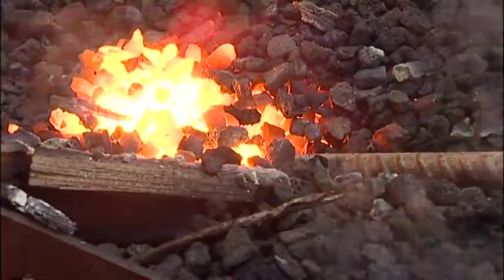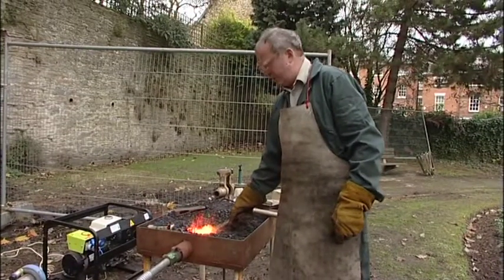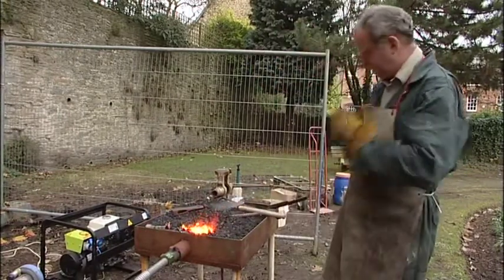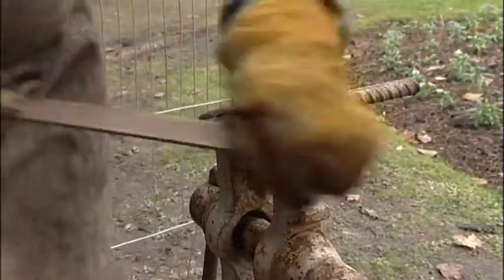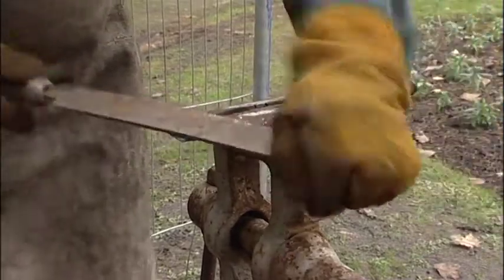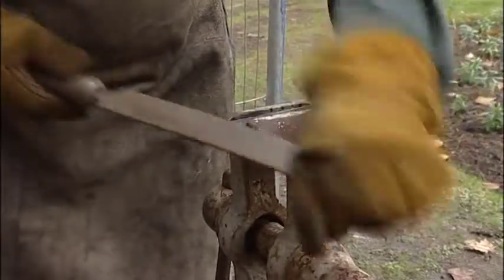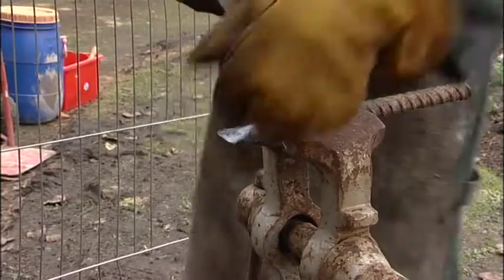The tool is reheated to approximately 800 degrees centigrade, which appears as a cherry red colour, and then it is placed into the coke to cool slowly and absorb carbon, which forms an iron carbide, which itself becomes very hard and gives greater wear resistance and longevity to the tool. However, this can become brittle, so the metal is reheated to temper it and integrate the carbon into the structure of the steel to allow it to become both ductile as an item but hardened at its work point.